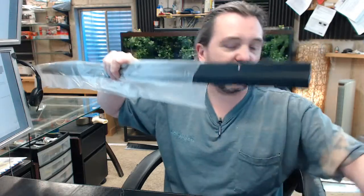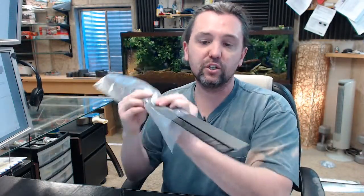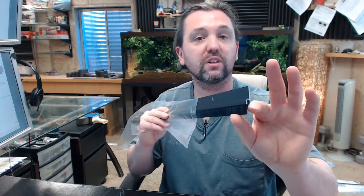This is a bit less common because the height of the holder is one inch, and why you might want that is you might have an unusual undercut. It would be more agreeable to have a longer holder than a longer brush. That holder will certainly be more resistant to fatigue over time than nylon bristle will be. So if I had an excessive undercut — let's say a quarter inch greater than standard — I might opt for a one inch height holder with the same standard half inch length on the bristle.